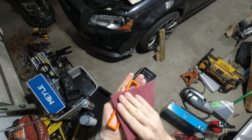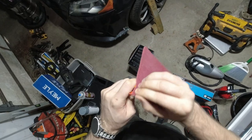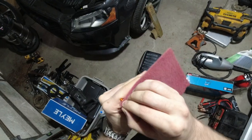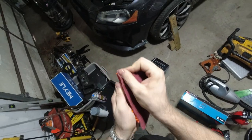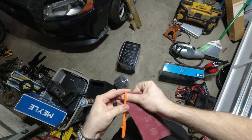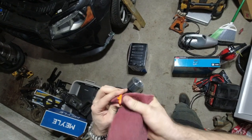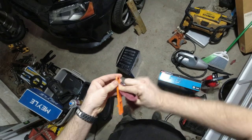So I got the orange thing. Just gonna scuff it up real quick. Gotta make sure there's no shiny spots left, otherwise it won't adhere correctly, and it'll start flaking off. Once this is done, I have the keyboard all cleaned up, and all I gotta do is brush on some self-etching primer, which has like an acid in it to adhere to metal,